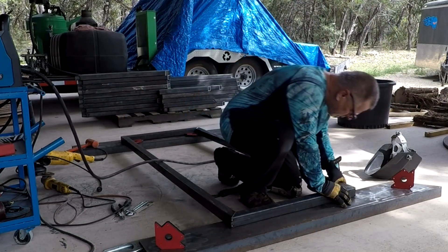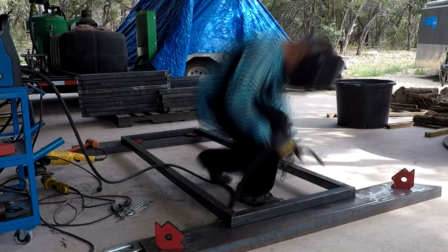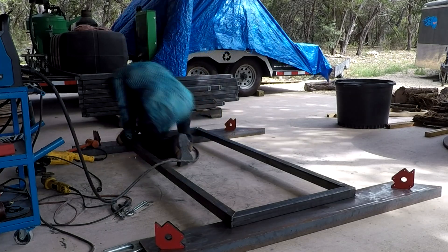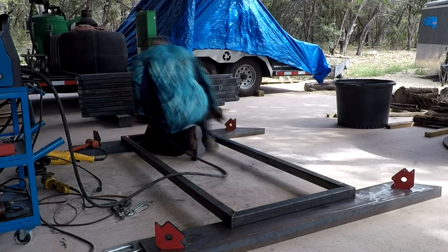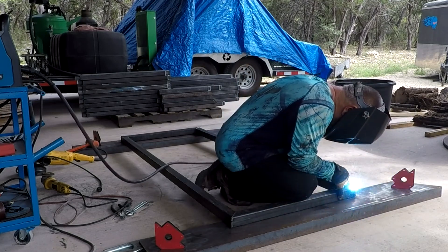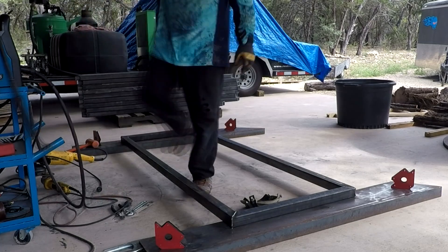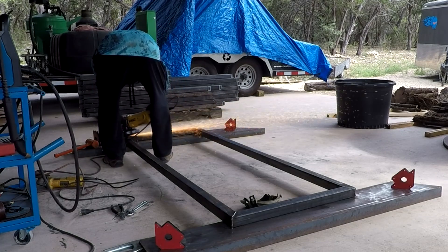I had to redo one — the height changed. Normally before I start welding I grind off any little weld snots that get onto the big c-channel I-beams that the magnets sit on. Those snots are not good — just little balls that fall off when welding and they should be removed before you lay anything flat. By the way, the c-channels are flat on the ground and the concrete back here is extremely level — Jose and his concrete crew did a good job. So the frames come out nice and trim.